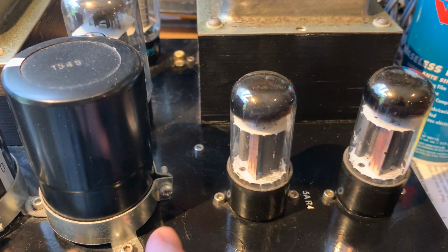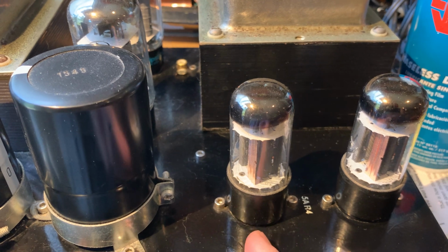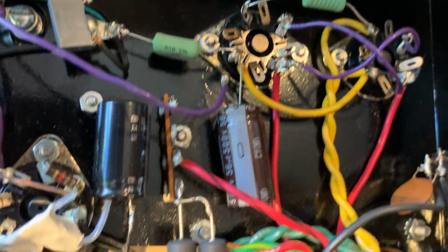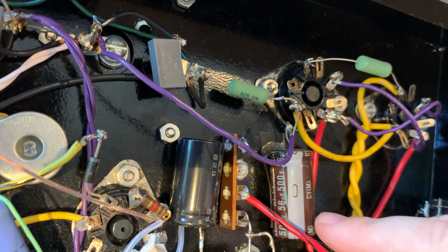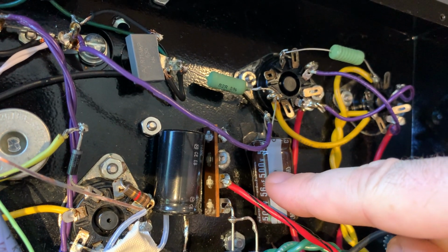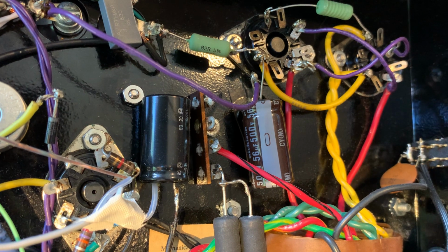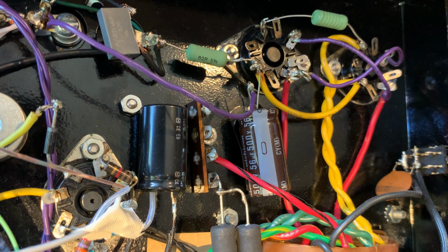But still, what I did is I placed a small resistor and an input capacitor. So what did I do? Here it is. You can see that bugger over there. So it's 56 microfarad, 500 volts. So basically I cut down the input capacitance 5 times.